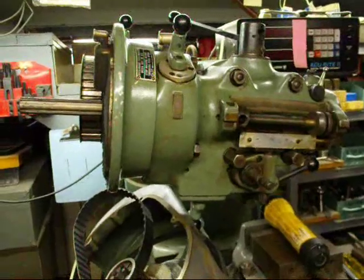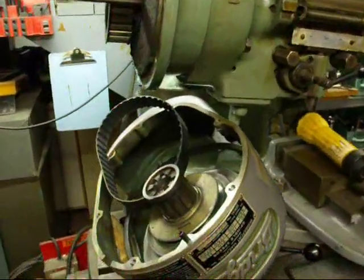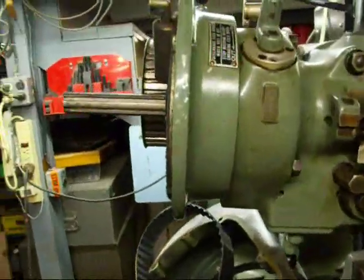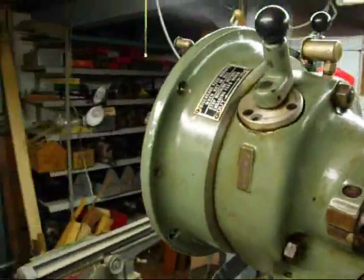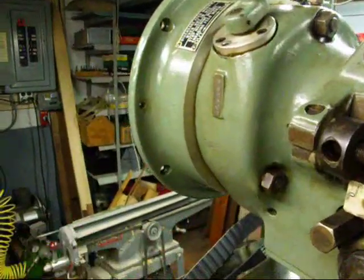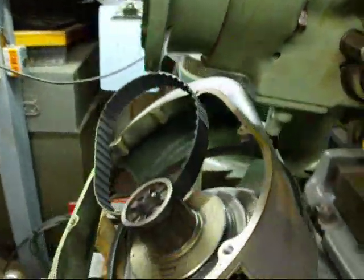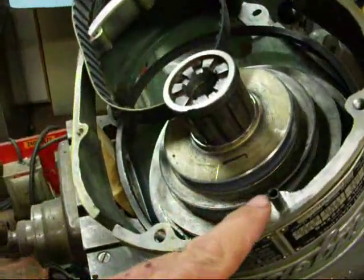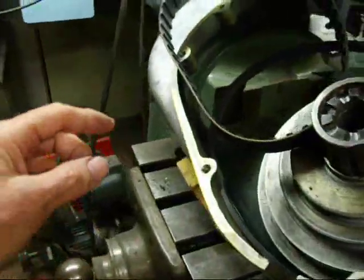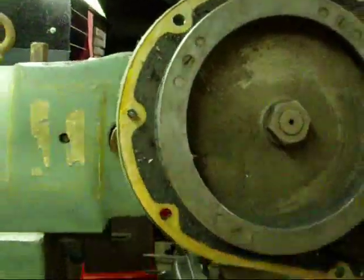The head has been tilted about 90 degrees and I took the top housing off. It was merely held on by six cap screws that go in these holes clear around the top of the machine. There are also two dowel pins that help align it, which are a little bit of a struggle as you pull it apart — there's the other dowel pin right there.